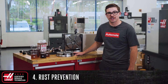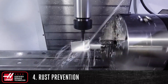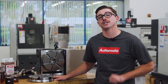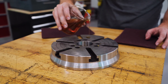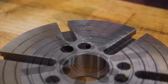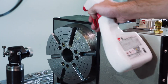If your rotary table or indexer is rusting, this is generally due to a coolant concentration issue where your coolant is running lean or less concentrated. We've made several videos on how to monitor and correct coolant concentration issues and we'll leave links to those in the description below. Once you have corrected the coolant concentration, remove any rust that has built up using a deburr pad and the same oil that is used in your rotary table or indexer. Once the rust is removed, wipe down all surfaces with a clean rag and apply a light coat of rust inhibitor to any exposed surfaces.